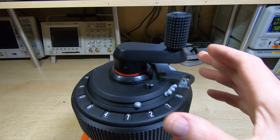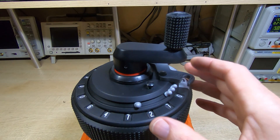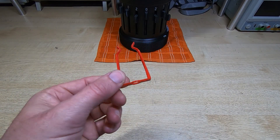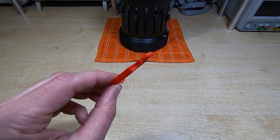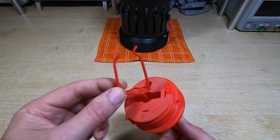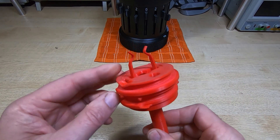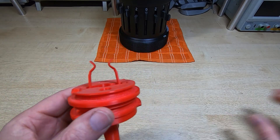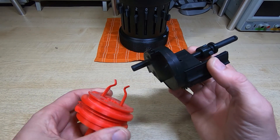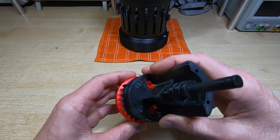I'll show you what's causing this and what I've done about it. I haven't fitted the replacement part to this yet but I have made it - it does require dismantling the entire calculator to swap it. If you've been watching this video series from the start, you may recall that one of the first components we fitted was this - the spring that is supposed to locate the step drum relative to the tens bell and hold it in position when you raise or lower the crank. The spring screws into the bottom of the tens bell and it's held in place with a couple of screws. This engages with the step drum. Normally there's a shaft that comes out of the top, but this was a prototype so I didn't print the entire shaft. It would normally sit like this and the two prongs of the spring go through these two holes.